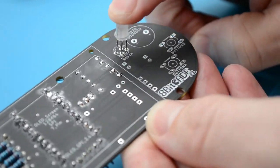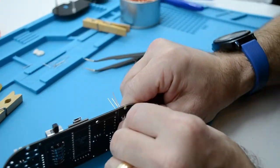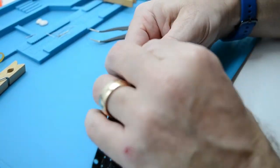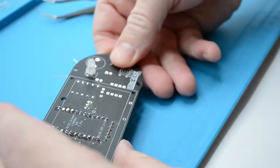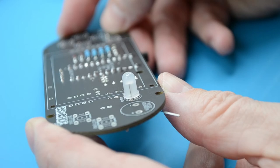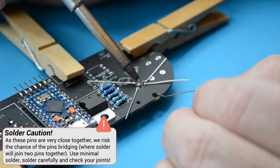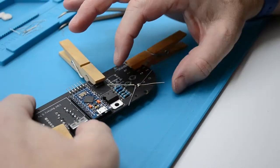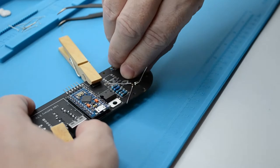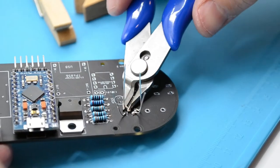Once you have the pins aligned correctly, push the LED into place so it is almost touching the PCB. Turn the PCB over and bend the legs of the LED to secure it in place for soldering — there should be little to no gap between the bottom of the LED and the top surface of the PCB. Once secure, tin the bit and solder the pins. Once soldered, bend the legs upwards, grab your cutters to trim the legs, and make sure to keep the trimmings so we can use them in later steps.